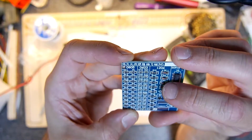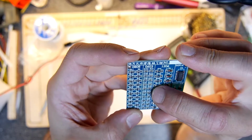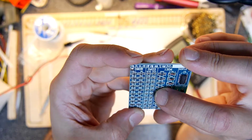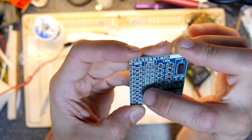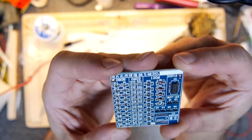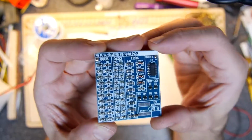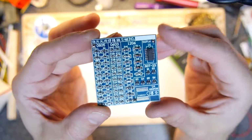I'll just tell you the values. I'm just tilting them to see. This one's a 3483, whatever that means. A 39, I want to say 39C, might be wrong there, and a 116 or a 911, one or the other, who knows. J3Y, standard sort of NPN transistors and signal diode. So you could use the parts on this for something, or use some Kynar wire and jumper it and make your own interesting thing.